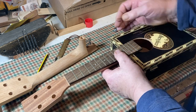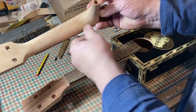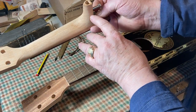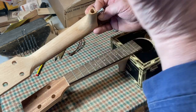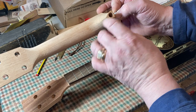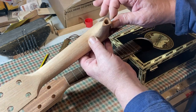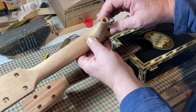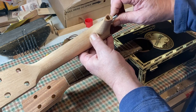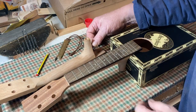This is the next one ready to go. We'll get that in position. I could put a spacer dowel in there, a bit of wood, so it won't drop too far. But I think if I just run a little bit of super glue in there, that'll hold it. Just make sure you don't get it onto that thread. I'll drop a bit of super glue in, put a bit of wax on, make sure it's in the right position, and then I can put my plug into there.